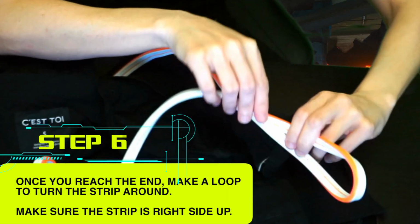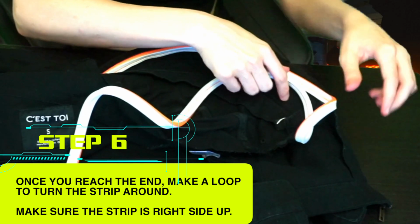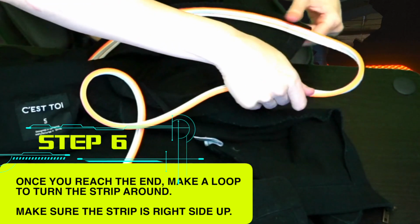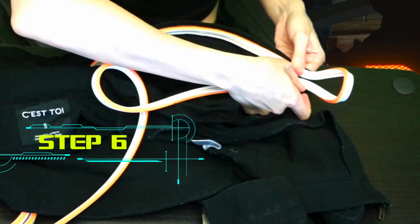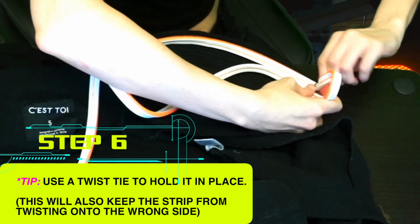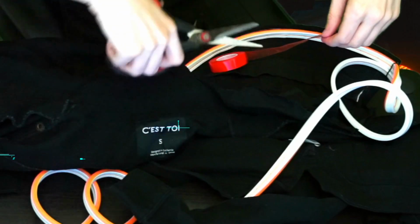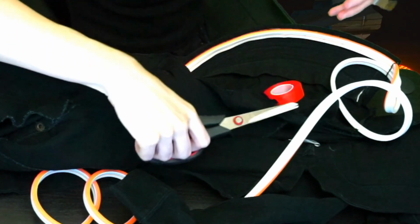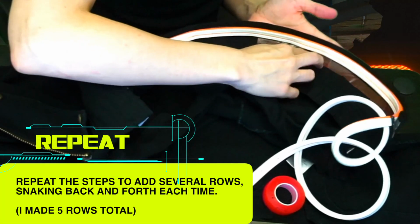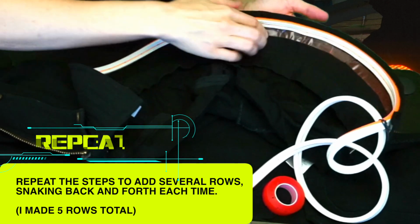Once you reach the end, make a loop to turn the strip around. Make sure the strip is right side up. Use a twist tie to hold the loop in place. This will also keep the strip from twisting onto the wrong side. I used the twist ties that came with the power supply, but you can also find these on Amazon, linked in the description below. Repeat these steps to add several rows of LED to the collar, snaking back and forth each time.